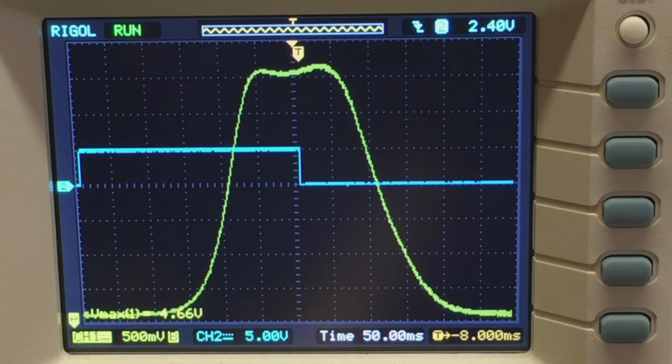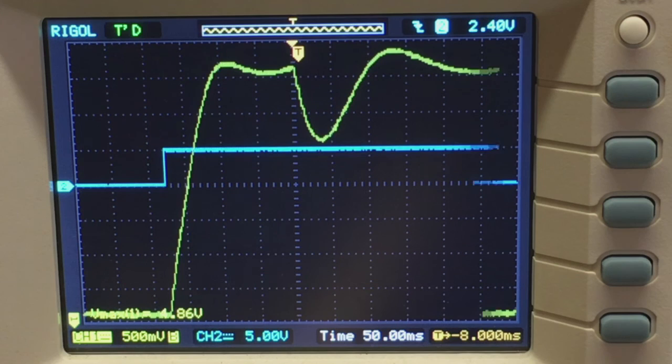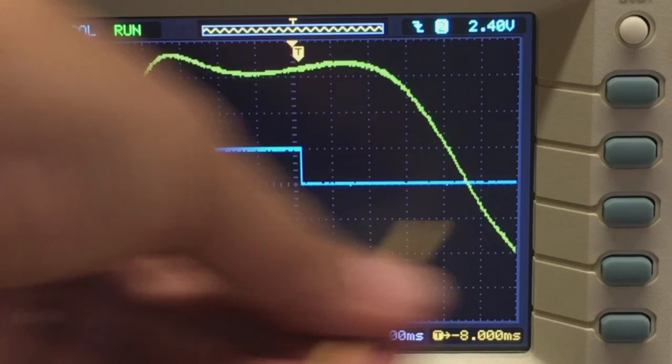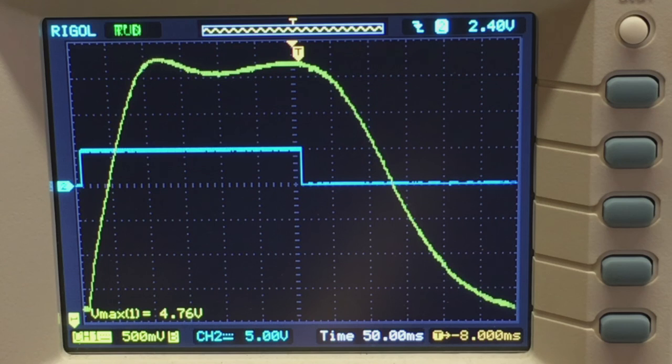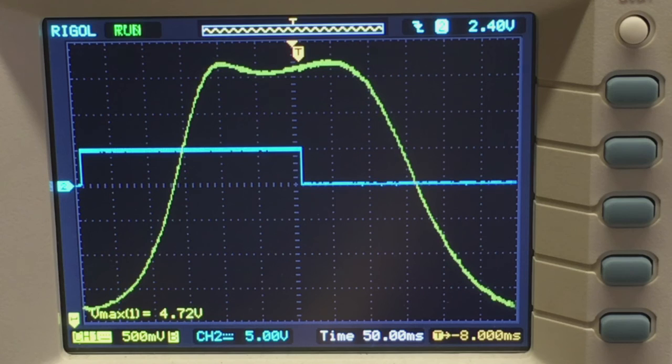So I'm going to start at 10.58 megahertz. And I'm going to stop at, I want 120, so 10.820 megahertz. That's a little bit too sharp, let me make it 30 per division, so I want 180 kilohertz that way and 180 kilohertz that way. So that will be 10.880 at the top, and at the bottom it's 10.52 megahertz. There we go. Okay, so what I'm seeing here is that the center is not exactly on 10.7, it's